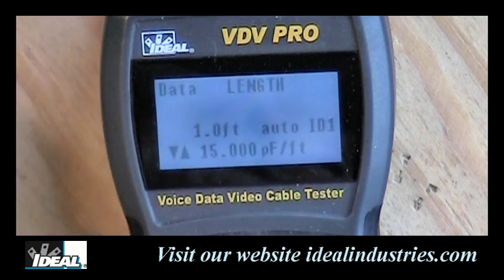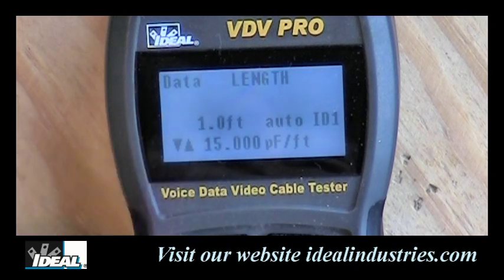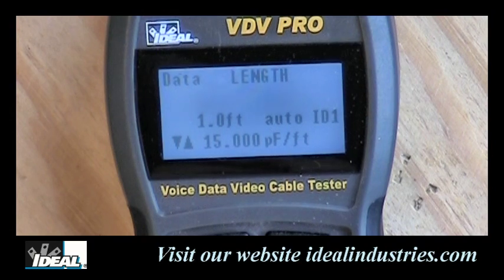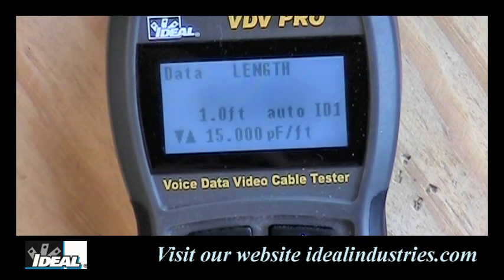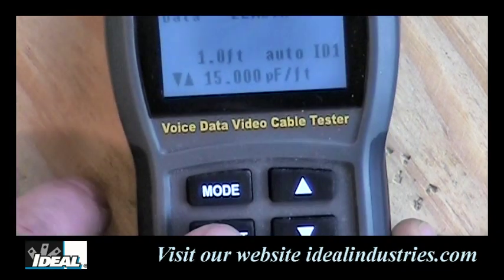It's in auto testing, and it sees, again, that first remote out there. And again, we're doing data over here. Now, the tester will automatically give you the shortest length it sees. Because if there's an open in the cable and you're expecting a 50-foot cable or a 100-foot cable here, well, we automatically know there's an open somewhere in one of these pairs. We don't know which one it is yet, but we can actually hit the select button here.